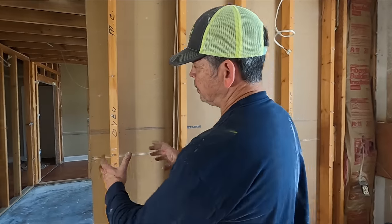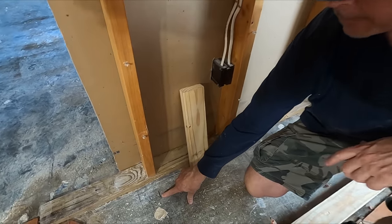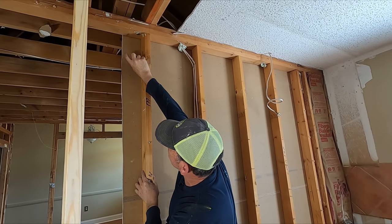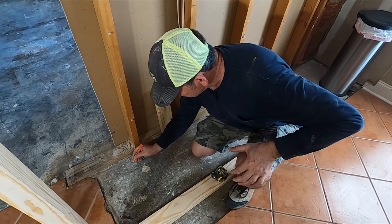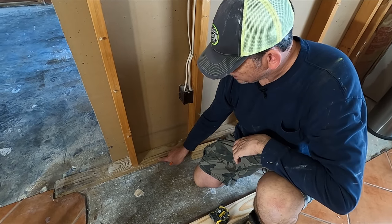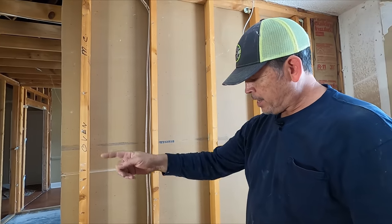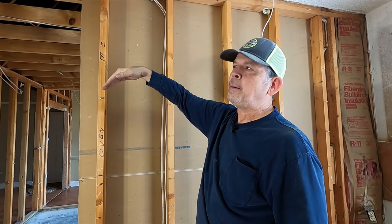On this end of our beam, it's going to sit on a post in this area — this wall stays. This mark on the floor is the end of my cabinet run, so we're going to have a lower cabinet and an upper cabinet ending at the same spot. The upper cabinet is going to have crown running around it and it'll have to die into the wall. So if this is the end of the cabinet run, I'm going to make the end of my wall right here — that gives me three inches for that crown to die into. Our beam support is going to be right here. We're going to add one more stud to our temporary wall, cut that drywall back, lay out our marks for our top plate, cut it, and remove it.